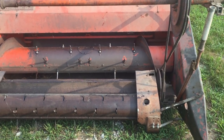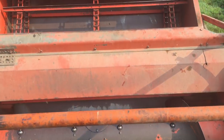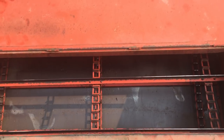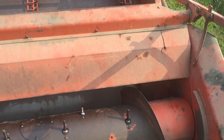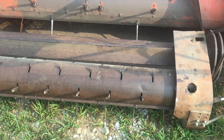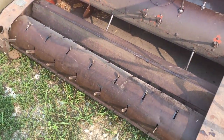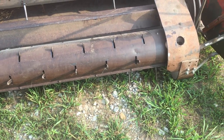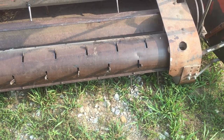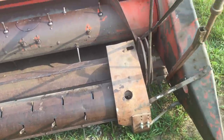What makes the 72 different is that throat right there. Rather than the canvas throat like on the 60 and 66, we have a chain slat throat. We also have the ends pickup there, and the fingers on the ends pickup are actually flat iron stock. Those work really well to keep debris out and to pick up the clover windrows very gently.